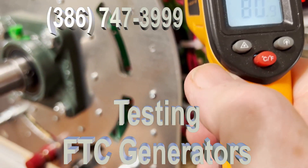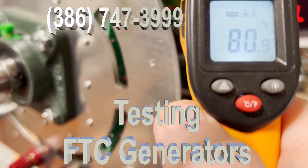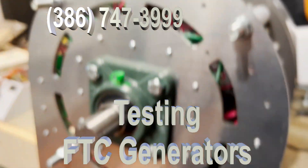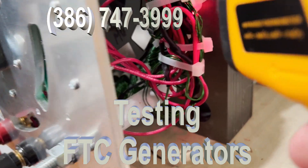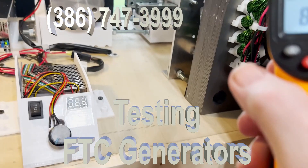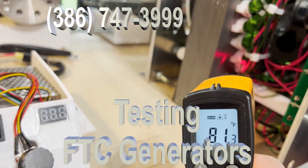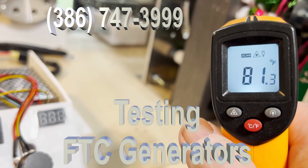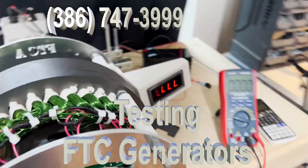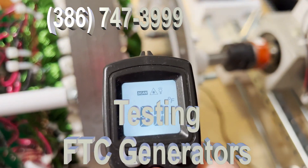Now we'll take a quick look at the temperature of the coils. This thing has been running all morning and we're running about 80 degrees Fahrenheit. Let's look at a few of them — you can get a sense of what it is. That one gets 80. We come over here and that temperature is 81. Down here is an 81. There's another 81. So the generator is running essentially normally — this is what we wanted out of our generators.